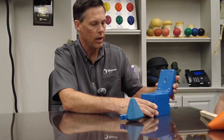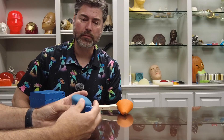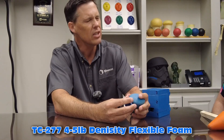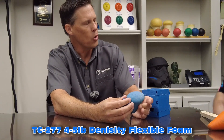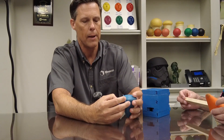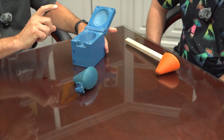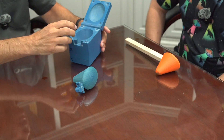The biggest challenge turned out to be mold release. The foam is TC-277, a self-skinning expanding foam — a lighter self-skinning foam, almost like a Nerf foam or a foam sandal, kind of stiff but very lightweight at about four to four-and-a-half pound density. After applying spray releases and waxes, the mold was still grippy. Part of the issue was not taking time to sand out the surface — if it were smoother, one layer of release might have sufficed.